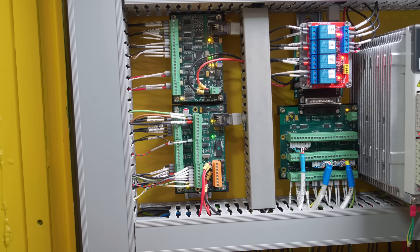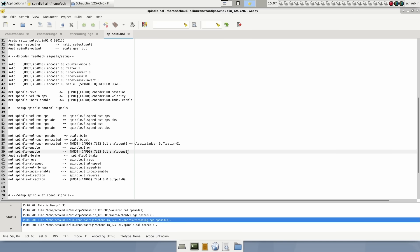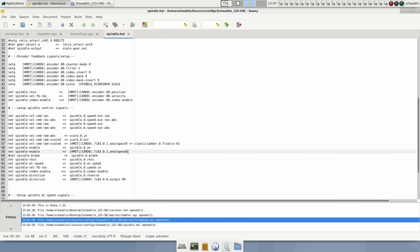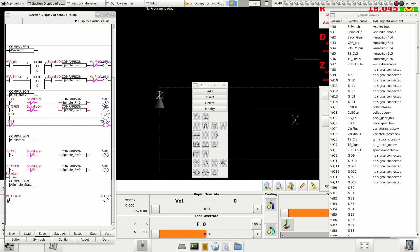Before I get that card back I'll just go ahead with option one. I've broken my HAL file — the whole configuration file for LinuxCNC — into a bunch of different parts. In my spindle HAL, the pin associated with LinuxCNC spindle 0 on connects to a signal called spindle enable, and that signal goes out to the Mesa card where it connects to the VFD and enables or disables it. I've inserted a link through Classic Ladder and back out, but I'm not doing anything with it yet — Classic Ladder is currently not altering it in any way.